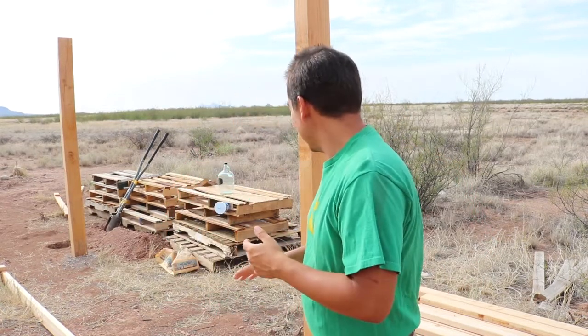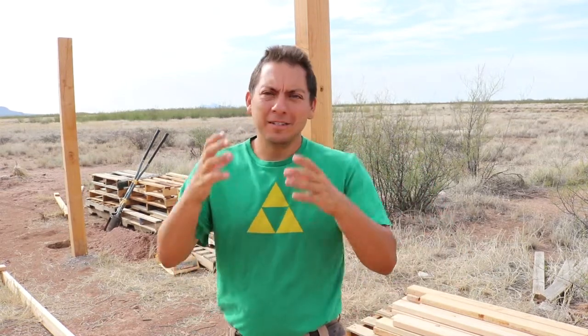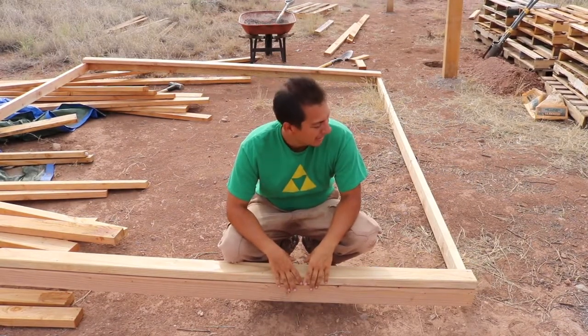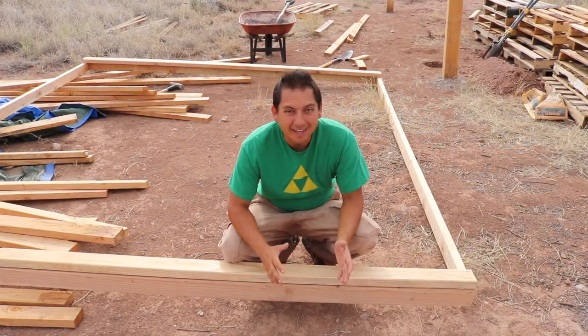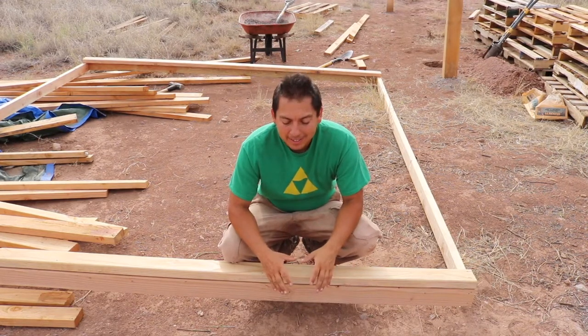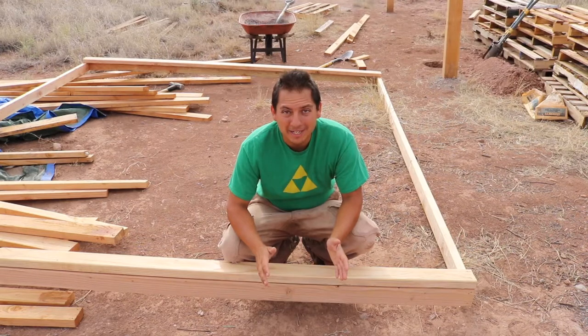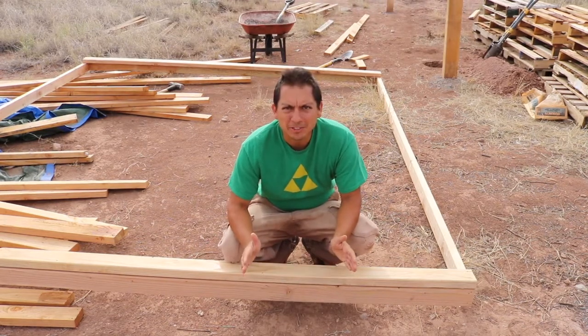It's taking a little while because digging these post holes by hand just takes some time. Then I get down to the depth and once you put the post in there it's like, oh well, maybe it needs to come out a little bit. I've actually built the first of the mounting structures right here. This right here will be the first frame, and I threw this together real quick so that when I was putting up my second post, I made sure I had enough room for it to fit in between them. Had I not built it, I was actually a little short — it would have been just a little too close by an inch or two and this wouldn't have fit. I'm glad I took the time to put this together just to make sure that distance was good.